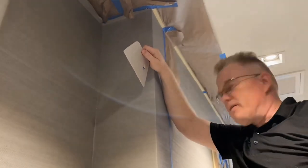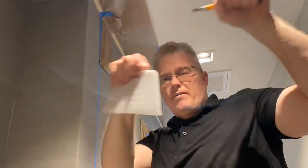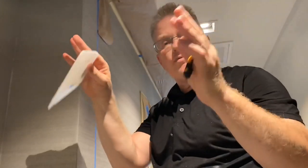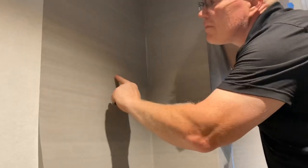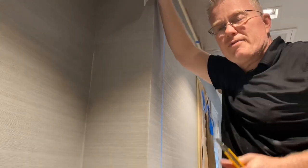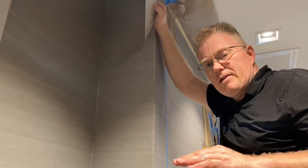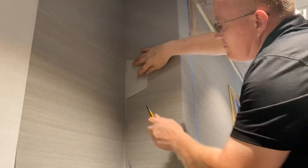Grass cloth is like a set of blinds. Picture a set of blinds, right? Fully extended. If you do this with them, what do they do? They zigzag, right? One doesn't go out, the other one. They zigzag. It moves in groupings of five or six veins of blind. Look at this. That's how it works, so you're not going to get any stretch out of it. You want to be careful that in inside corners you cut 3/16 of an inch and leave it under the sheet after we cut it.